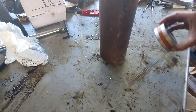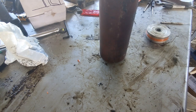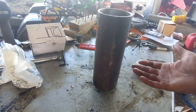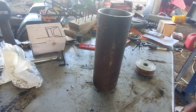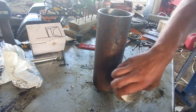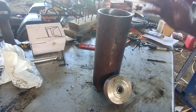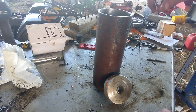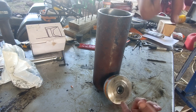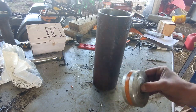The next thing that you'll need, of course, is the stroke, how long the thing is. And that's pretty obvious, I think. If it's too short, then it's literally too short. It can't do the job. If it's too long, then it's not going to fit in the space, right? So you need to have the same stroke. You can measure that by simply reassembling the cylinder empty, no oil in it, and just squish it all the way down and measure pin to pin, the hole at the bottom and the hole at the top on the yokes that connect to the thing. Pull it all the way out, and then take that measurement. The difference between those is your stroke. So you'll need to know those two things.